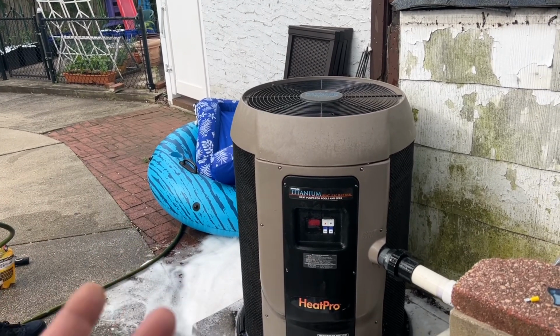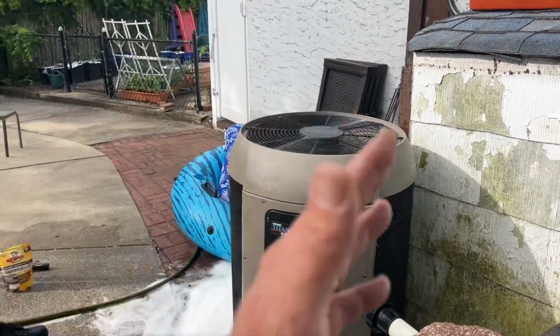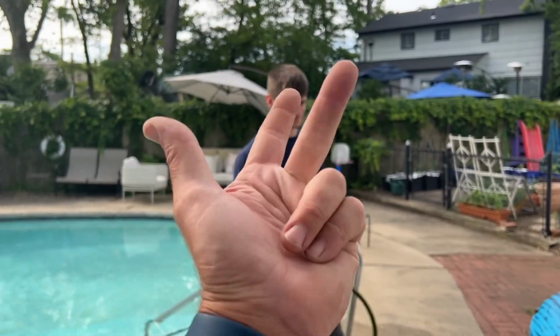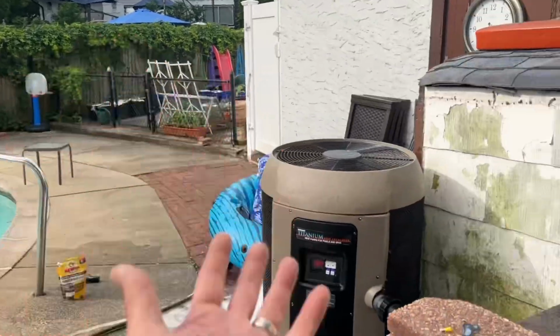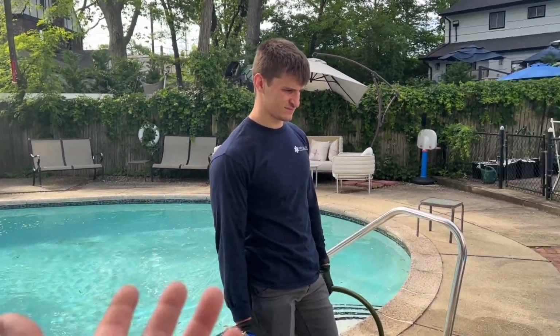Listen, I'm Mikey Pipes. I do plumbing, heating, and air conditioning. Heat pumps are kind of a new thing to me, but I know a heat pump is the reverse of air conditioning. If you know the refrigeration cycle, there are four basic components: a metering device, an evaporator coil, a condensing coil, and a compressor. That's basically it in the refrigeration circuit. So if you know that, you can do rooftop units, heat pumps, and commercial refrigeration in restaurants and supermarkets, things like that.